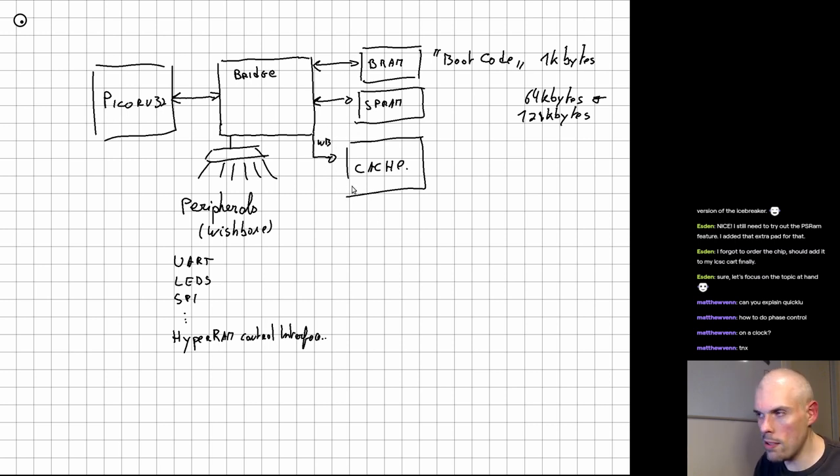It doesn't have any wait states and stuff like that. It's basically the same as the BRAM and SPRAM interface. It's basically as fast as is possible with the PicoRV interface here. There are no pipelining stages, basically, while here there is a bunch of pipeline stages in both directions to break the critical path. So if you do something like this.